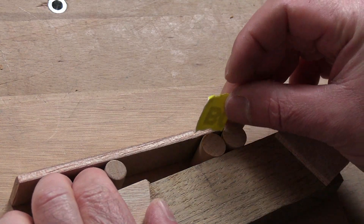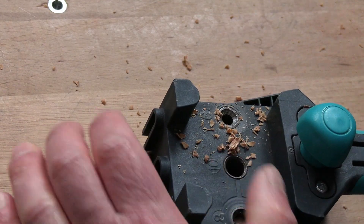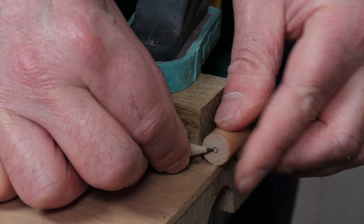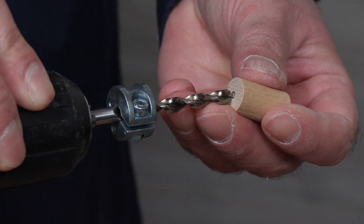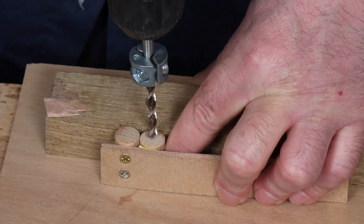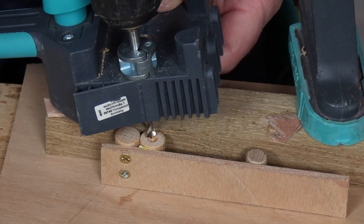A piece of sandpaper helps prevent the pieces from spinning while drilling. And of course, that hole already came out crooked. This was when I discovered I had to mark the center of all the pieces on both end grains, mark them with the drill bit tip carefully and precisely, clamp them well, make a well-centered pilot hole, and now yes, with the doweling jig, drill the holes.